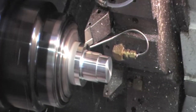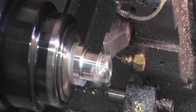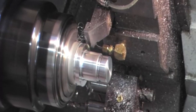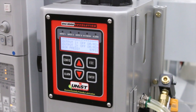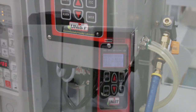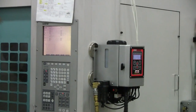So with the dual channel system you have a much faster reaction time to changes in fluid delivery. In something like CNC machines that have lots of complexity and tool changes, you're able to quickly change the amount of fluid being applied depending on how the machine is set up and what tools are working where. For those types of operations where a fast response time is needed, our Revolution system set up with dual channel outputs can integrate with your CNC program and give you that quick response to lubrication changes that you need.